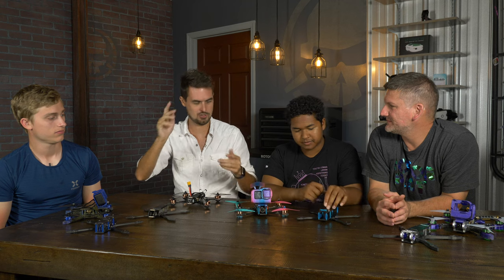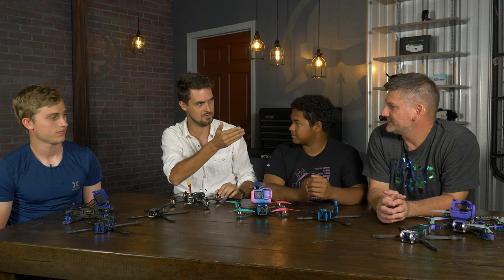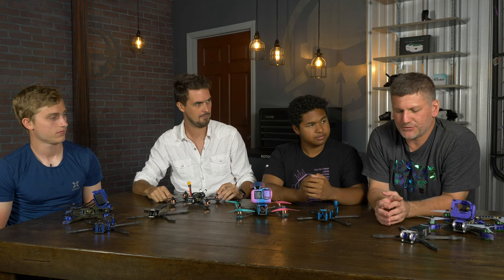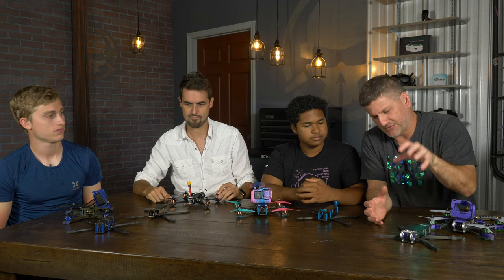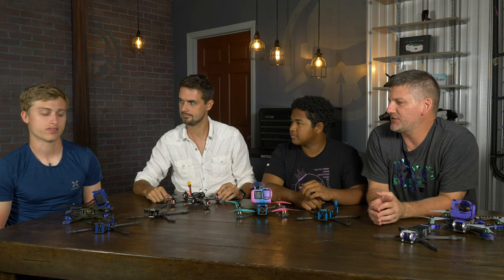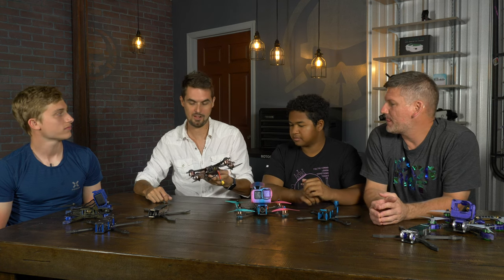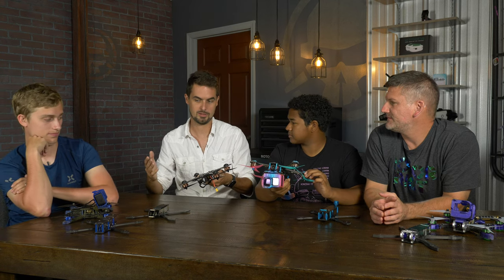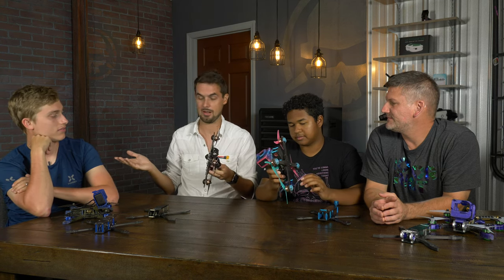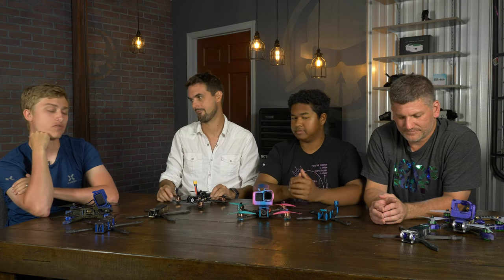When you cut out this truss shape, you've made it weaker to save, like you're saying, just a couple grams. It's the lightest material per square inch that we use in our drone frame. So why are we trying to make it so much smaller, when we can focus on the other parts that are really heavy per square inch? There aren't any science holes I'd want to add to mine, other than maybe I'd cave in and do a couple slots down here to help with cooling. But it's not that I have any problems with overheating or anything. But it helps your VTX, I think.